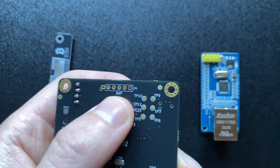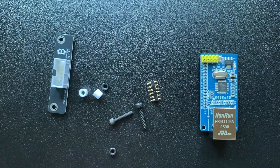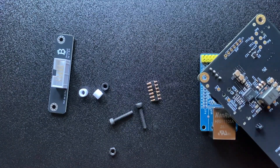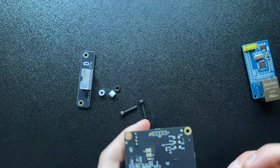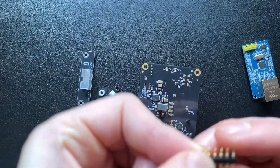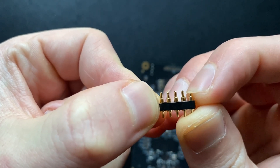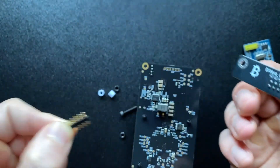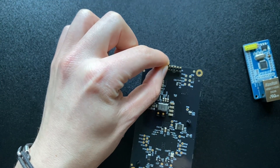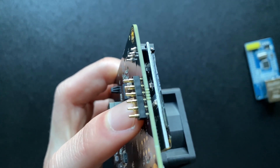It needs to have the port on the back for you to assemble it and stick the pins through so they can communicate with the LAN module. For the bitaxe setup, the first thing you want to do is put in the pogo pins. Note that some are locked in place at the bottom and some actually spring downward. The spring ones go on top connecting into the module, and the static ones drop in at the bottom.